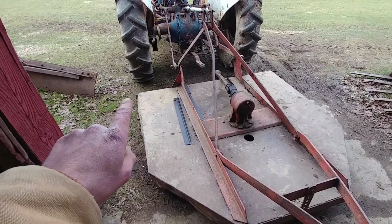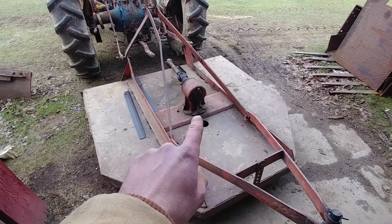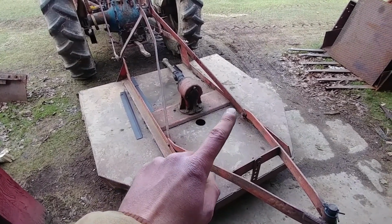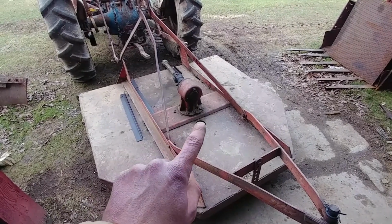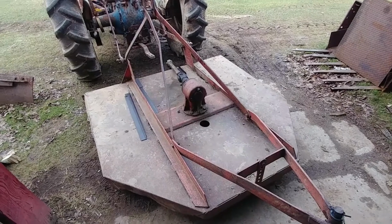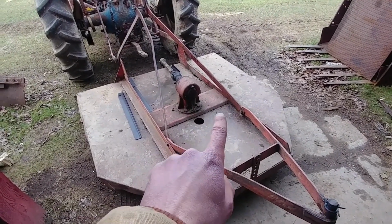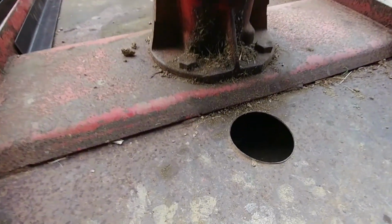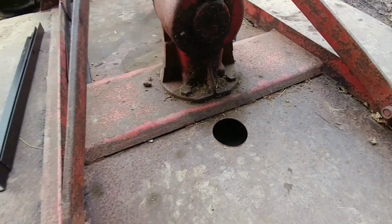And there's another little crack right on the edge here that needs welded. And I think I'm going to weld where the gearbox goes the entire way. They only did a weld. It's fully welded on the side here, and then one little weld in the middle. So I'm just going to weld this fully. This back one, or no, they did two welds, one up here and one right here. But this back one here has broken, and it should be welded solid.